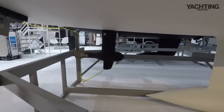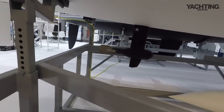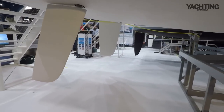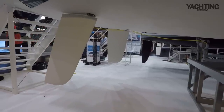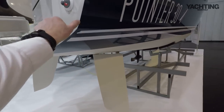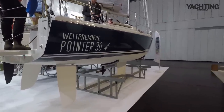On to the motor — we've got a pod drive for the electric inboard. It's not an inboard, it's a pod drive; there's nothing inside apart from batteries. Most people are opting for that, albeit lots of these boats are going to Holland where the inland waterways prefer electric over diesel. There is the option of fitting a diesel with a sail drive if you want it. Coming aft, we've got twin rudders, relatively shallow but pushed fairly well outboard so you get lots of grip when the boat's heeling. No massively hard hull chines; there's a slight chine just as you come towards the stern to maximise form stability. Otherwise she's a relatively conservative, light displacement cruising yacht of 30 feet.